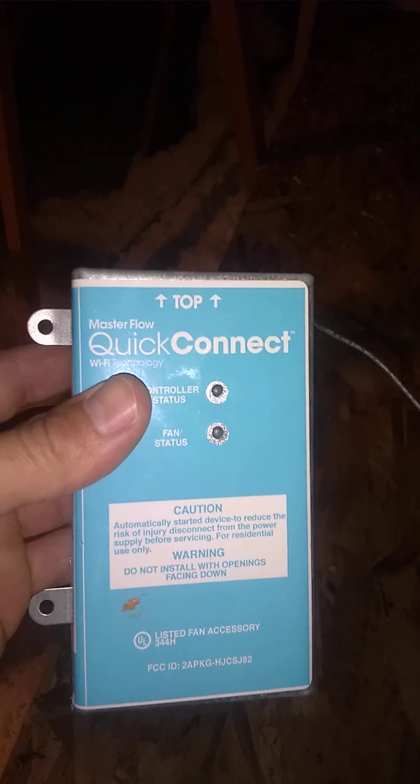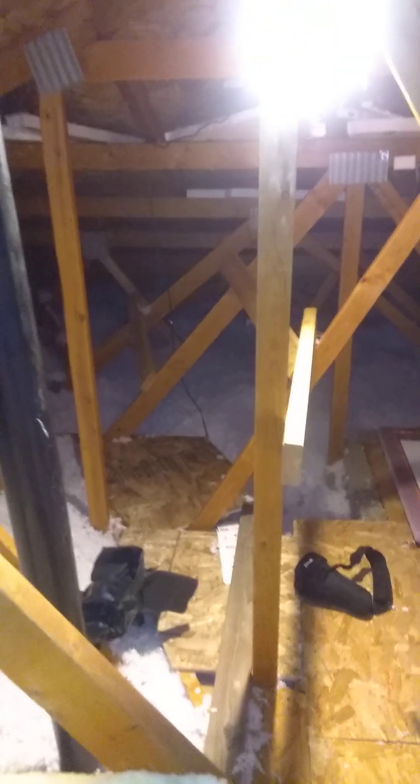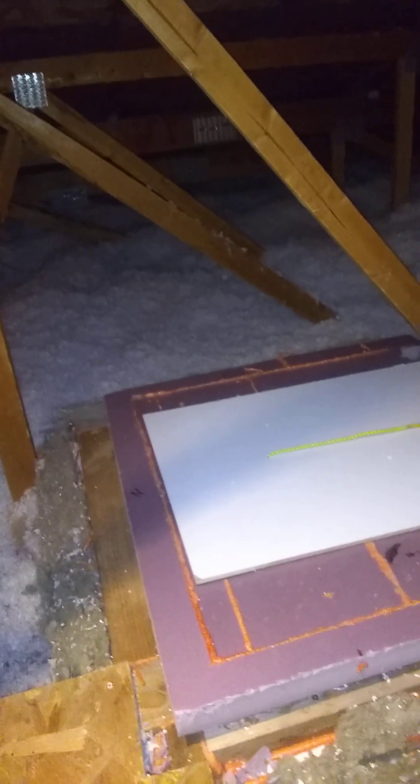I hope that helps — I was extremely frustrated, which is why I posted this. For us, I really think it was mainly the air sealing and insulation of the foam board that helped solve our ice damming issues. I also installed a camera — just a Wyze camera — so I can see if the ice damming is under control. I installed a light connected to Wi-Fi so I can turn it on and off along with this fan. We also significantly upgraded our attic access — that's like R30 or R40 — with another R20 on the actual lid underneath. Hopefully you find this helpful; if you have any questions please let me know, thank you.